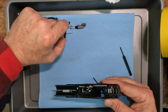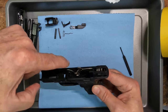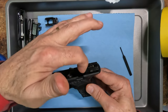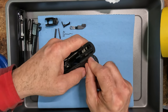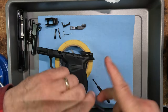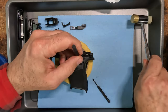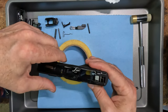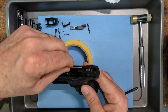The pin for the trigger pivot also holds that. The sear holder housing is all in this piece back here — it'll come out as an assembly. That's the pin for it right there. I need the small punch again, see if I can get lucky just pushing these things out. When I say hit, I mean kindly — I don't mean bang anything. Use the soft side here — she goes right out. Pull her all the way out.